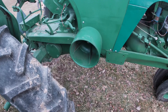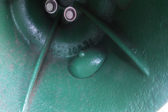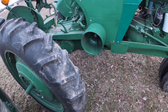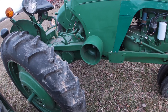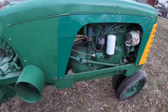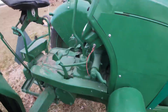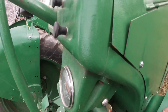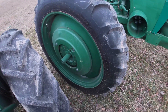It's smaller in diameter with an L casting number — 1L691 instead of 1K691 like the others. I was lucky enough to find that at a neighbor's: I had a part off a Super 44 that he needed, and he had this pulley, so I was able to acquire it to complete the tractor. It's basically just an updated version of the 66 — it's got disc brakes, a tachometer, and uses a key to turn the power on then a push button to start.